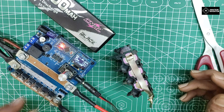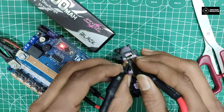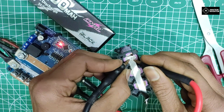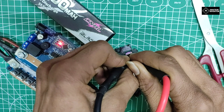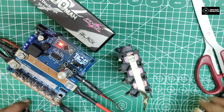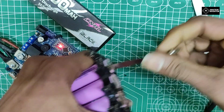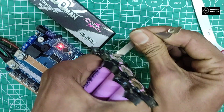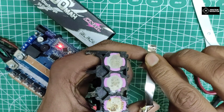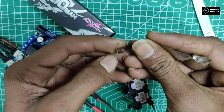It broke, so I think if I increase the pulse time to 10ms it will hold better. This time the pulse seems to be a bit stronger. I applied a lot of force to it and I must say it was a good weld. It eventually came out not because the weld was weak — it was because I was strong! There are holes in the nickel strip which means it tore apart from the battery.